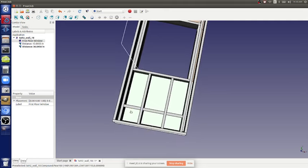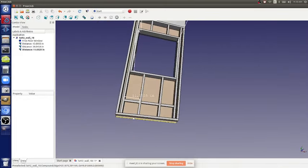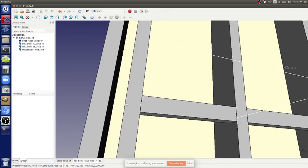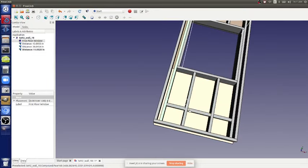14-inch, yes. Exactly, the side ones are going to be a little shorter. And what are they here? I forget what they are, so the side ones are 11. Does that make sense? Yes, because when you look at these two spaces more here, that's another 3 combining to 14. So this one plus the space here, you know that it adds up to 14 like it should, because we're trying to keep everything to 14 for standard insulation, like comes in the United States.